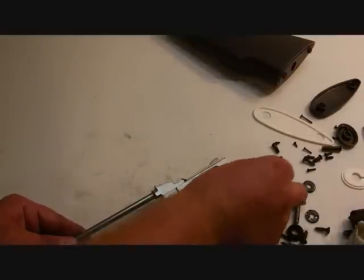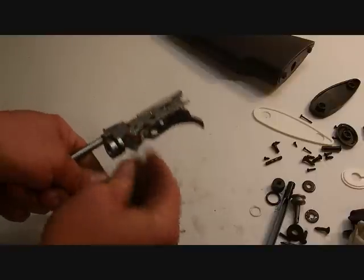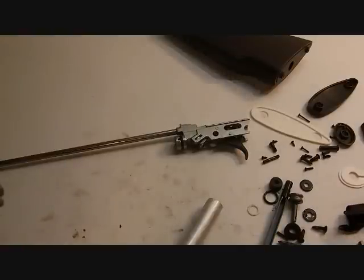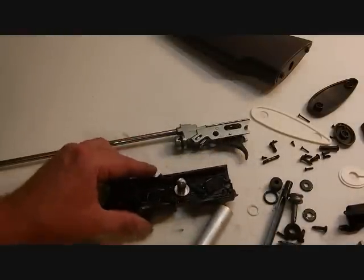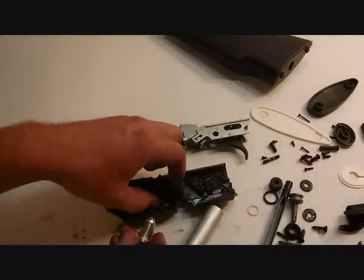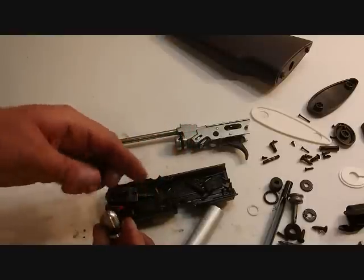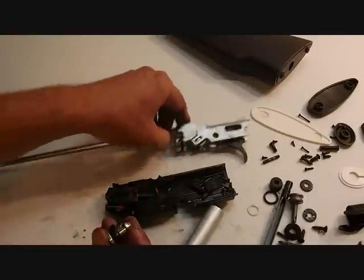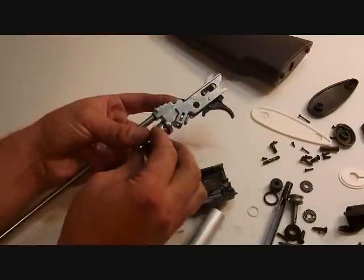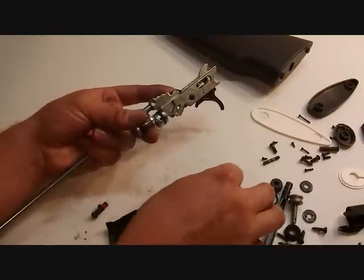We got to put the O-ring for the bottom of the pump tube back on. Then we put the pressure chamber seal assembly back together. It is comprised of the machined abutment washer, the seal itself, the seal spring, and a pin to hold it in. This seal contains the pressure that you pump up.